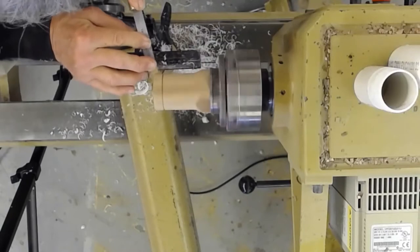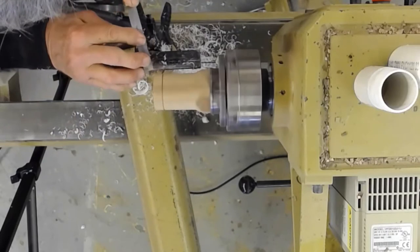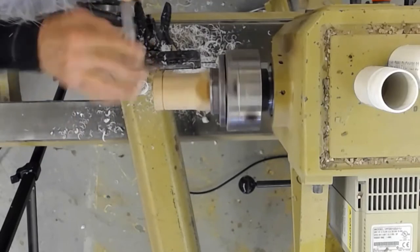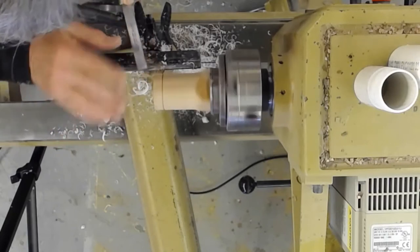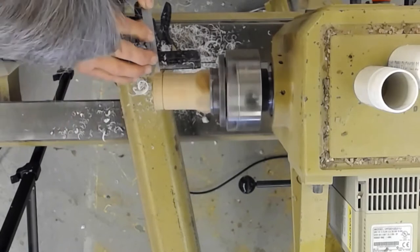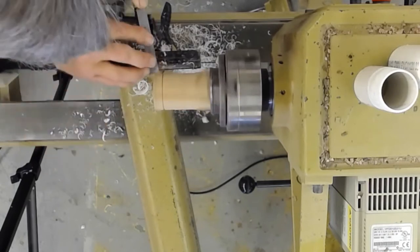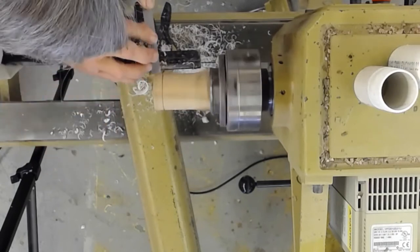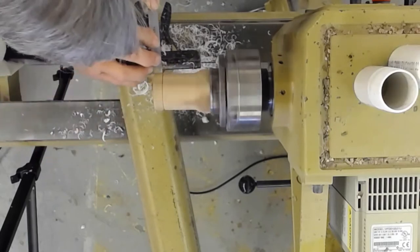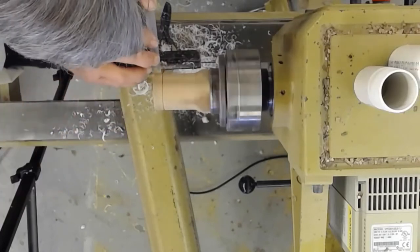And you're starting in the middle of the cutting tool on the forward corner. Correct. That's right. I'm off that first tooth. And I'm taking it easy. I'm trying to get that thread to spiral down, start carrying my tool by itself. There she's beginning now. All right, now we can let the thing run itself.